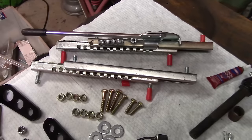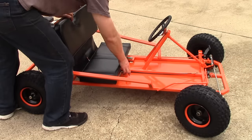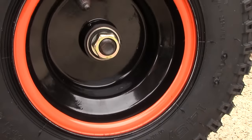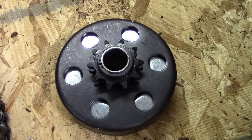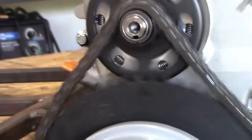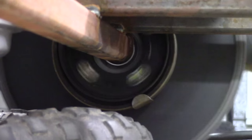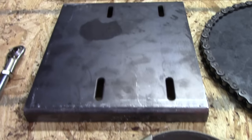Next is the bench seat with the seat sliders or seat adjusters — combined, they let you have a short or tall rider. Then we have the remaining three wheels with the tires and bearings, which go right on the go-kart. We have the centrifugal clutch, sprocket, and chain, and when they're all installed, that's what propels the go-kart forward when you step on the gas. You need to stop, so you have a brake band and a brake drum — when you step on the brakes, it squeezes on the drum and lets you stop.